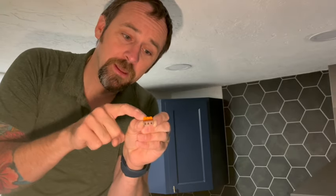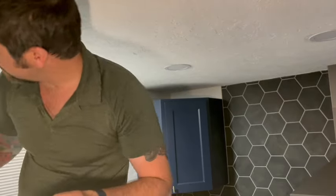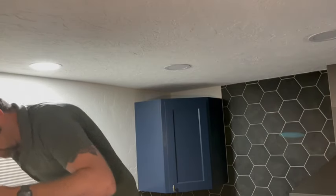In these lights, I take a white wire, snap it in, then I take the white wire on the light, snap it in, and then I take the next white wire that's going to the next light, snap it in. So it's a way to get 3 wires connected. It's much more secure than your basic wire nut, and you can just unsnap them, take the wire out. It doesn't damage the wire. You don't have to worry about taping the wire nut or worrying about the wire nut coming out. It's super secure. This is a new thing. I'll put the link to this on Amazon.